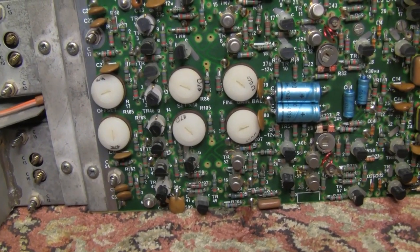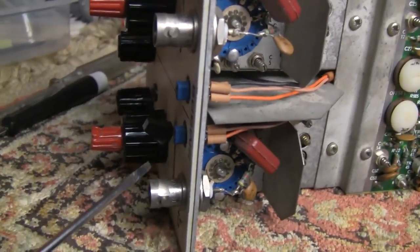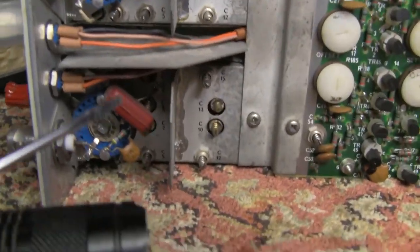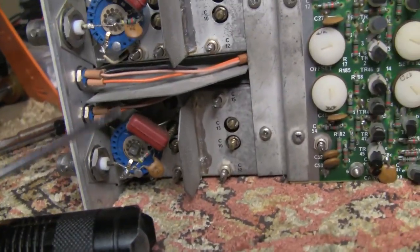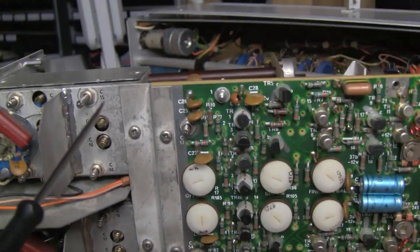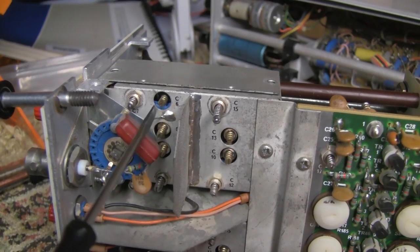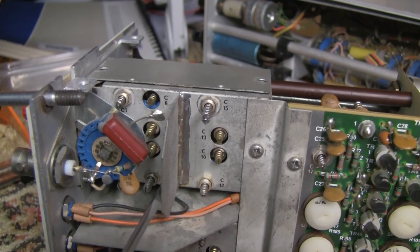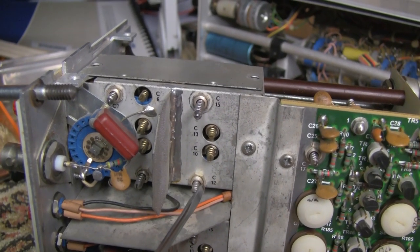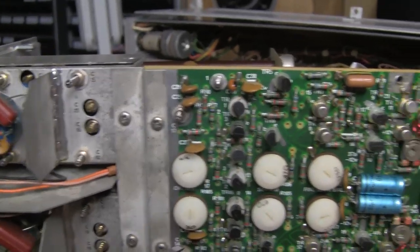Can't find anything coming in either. The channel input is right here and it goes in through the selector. Then there's this attenuator box — just completely sealed up, full of capacitors and resistors and things — all of which can be adjusted when you calibrate this scope. Nothing coming out of this thing at all.